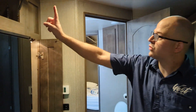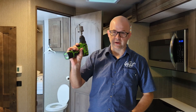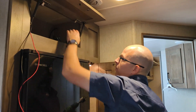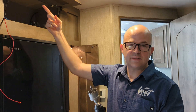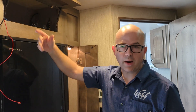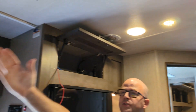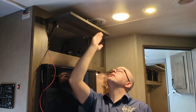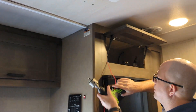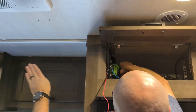We've got our power up and running. Now I've got to drill a hole in the roof, install a box, and get ready for the Starlink. I won't be able to install my antennas until next Wednesday. I'm going to test out this new drill that comes with the install kits on our website. I want to make sure I have clean access to the roof. I'll drill a hole so I can check for any electrical wires up in the roof. Electrical wires typically run this way, air conditioning vents go this way, so I want to be offset from my AC vents and from any wiring.